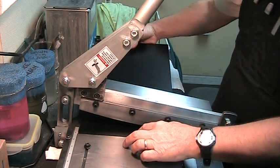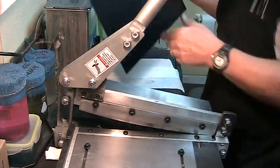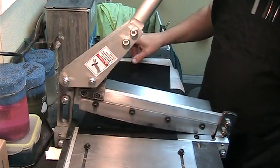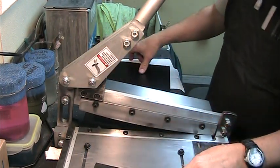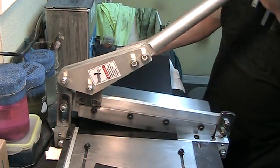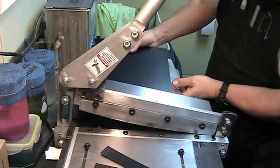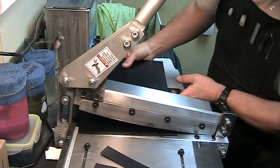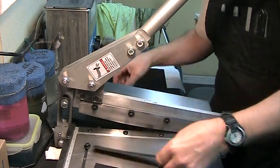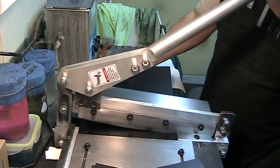We put the piece in from behind, press against the stop, cut, and flip the piece every turn. The reason for flipping is that if you're out of parallel even a thousandth or two on your setting, you won't gradually get out of square. This way it alternates back and forth and maintains the squareness of the other end, which is relatively important for what we're doing.